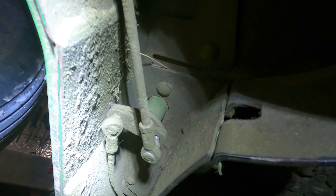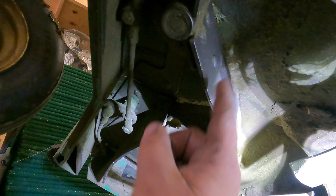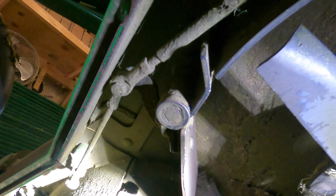So what we've got here — the actuator that you can see turning is right here. It should be pushing that open, and it should also be moving this chute right here and this chute right here. And nothing is moving except that the actual discharge chute's moving a little bit. These aren't moving at all. So let's see if we can get some WD-40 in there and dissolve the buildup, and then hit it with some actual lubricant. I think there are grease points up above this that we can check.